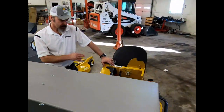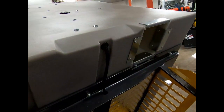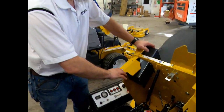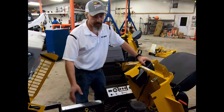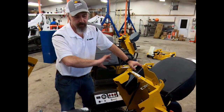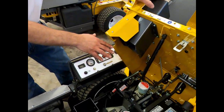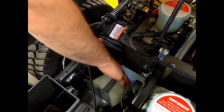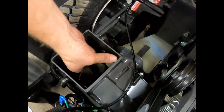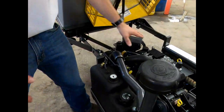I mentioned airflow when we lifted up the deck. On your normal mid-mount mower, there's a big tube that runs out the side and dumps into a bag — all that powers the grass is just the force of the blades pushing air through. On this machine, the blades create the same initial force but blow the clippings out that opening in the deck, into this tube, where they hit this blower which speeds up the grass even more, then blows it out this chute into the hopper.